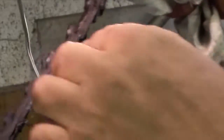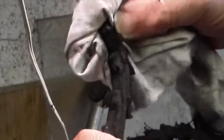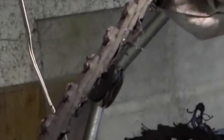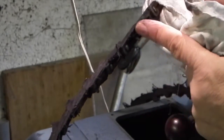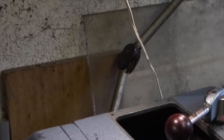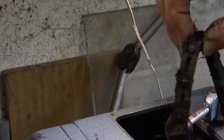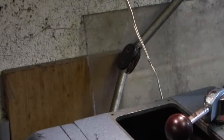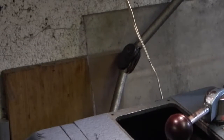I've split the links on the belt — as you can see, that's the belt. Each link is held together with a type of rivet. You can see from touching it the dirt and the oil on this. It's saturated in oil and it's started to delaminate. Also, when the belt's in the pulley the top of the belt is level with the pulley, so the bottom of the belt may be bottoming out rather than gripping the sides of the V. That belt was at least 45 years old — it was the original belt.